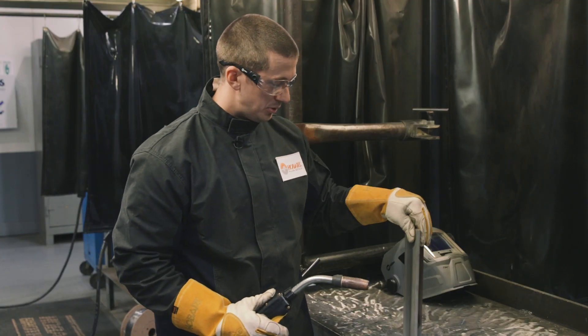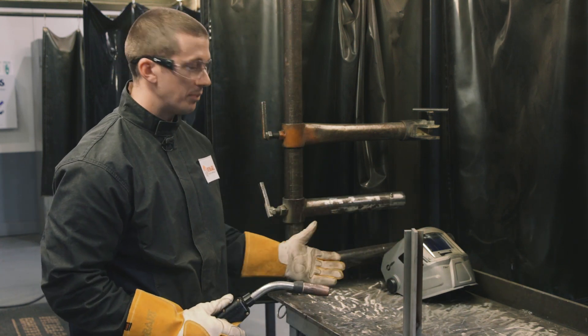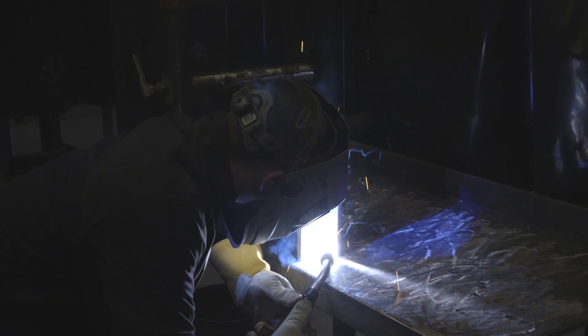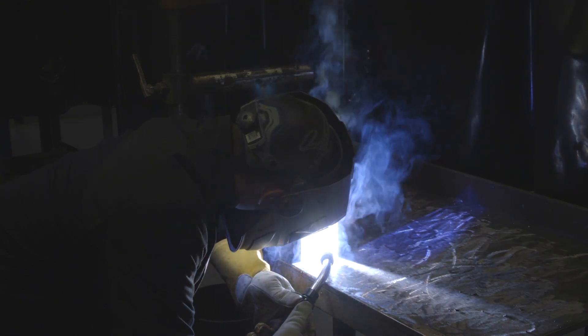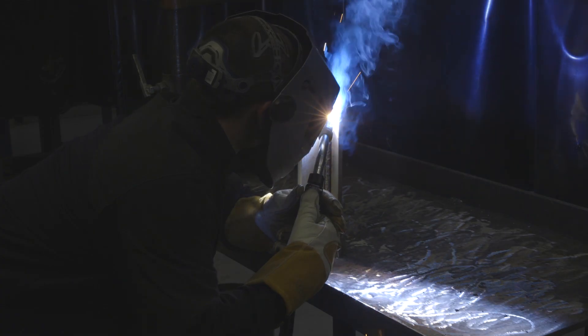The product is also capable of welding out of position. For an example of a vertical up welding position, which is what you see here, it's a little bit different technique. You would position the gun like I have it currently and use a slight — meaning 5 to 15 degree — push for the vertical up travel angle, and obviously start from the bottom of the joint and work your way up until the weld is completed.